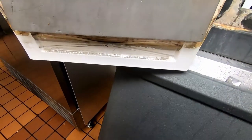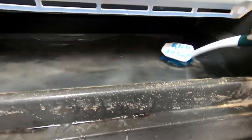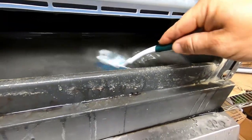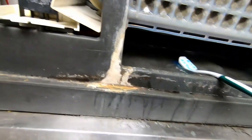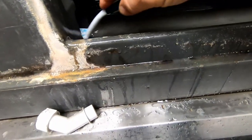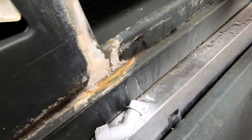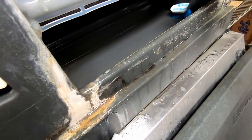We'll go through and get some of this nasty stuff cleaned out, get the bottom there all drained out, and get her all cleaned up. All this gray stuff down here that I'm stirring up — that's the nickel coating they put on the plate. It usually stays in the bottom so it doesn't go anywhere major. I like to pull my little drain tube here, and that helps siphon it to fall out a little better than hoping it eventually drains on its own.